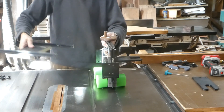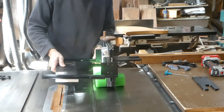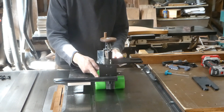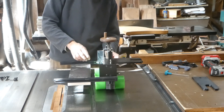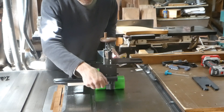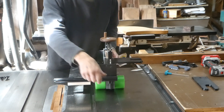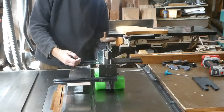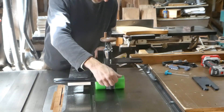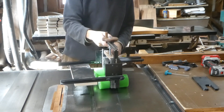For table saw use, you will slip it into the table saw holder and the steel pins engage. Then the Delrin bar — there's a set screw that will limit its travel, and that should be at the right spot for attaching the knobs. On the off chance that it's not, you can move that set screw. When you're putting the knobs on, it's easy to do it two at a time on opposite sides. The feeder is now installed in the table saw holder.